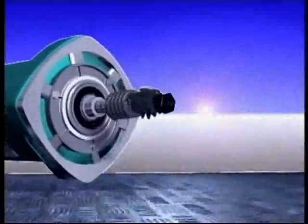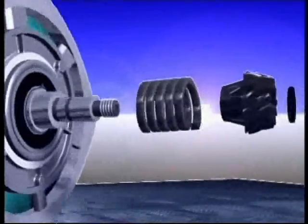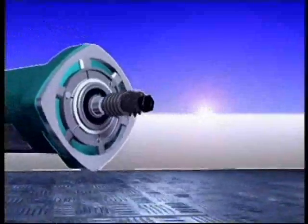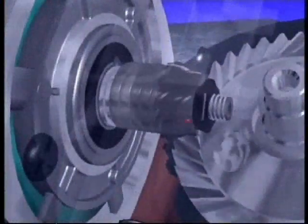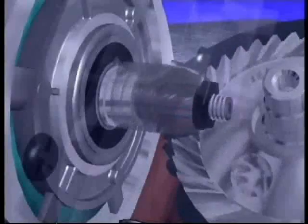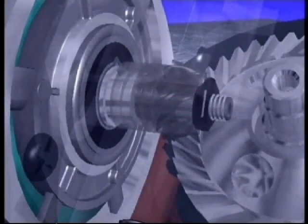So what is SJS? SJS incorporates a coil spring located around an internal drive spindle. When grinding, the coil spring is tightened around the spindle to produce a positive and constant drive to the wheel. Upon overload, the super joint system loosens the coil spring to allow the spindle to rotate freely to disengage.